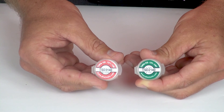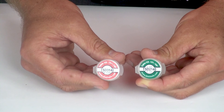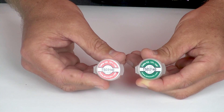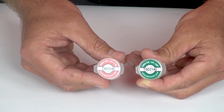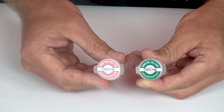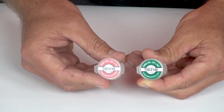Please note that for the three conductor die sets, they only have one blade producing one cut on the outer jacket in order to remove it from the cable. All other universal die sets for single, two conductor, and four conductor have two blades producing two cuts on the outer jacket.